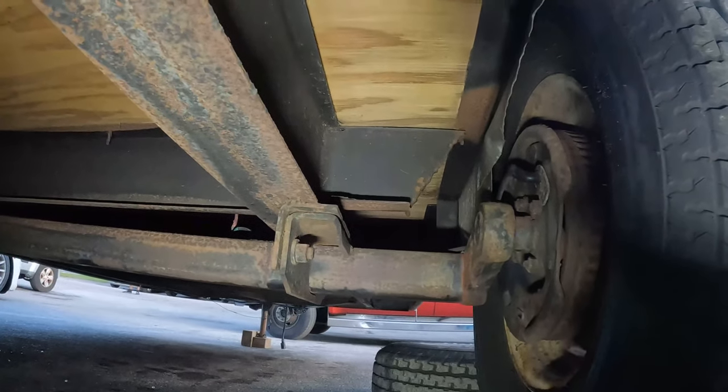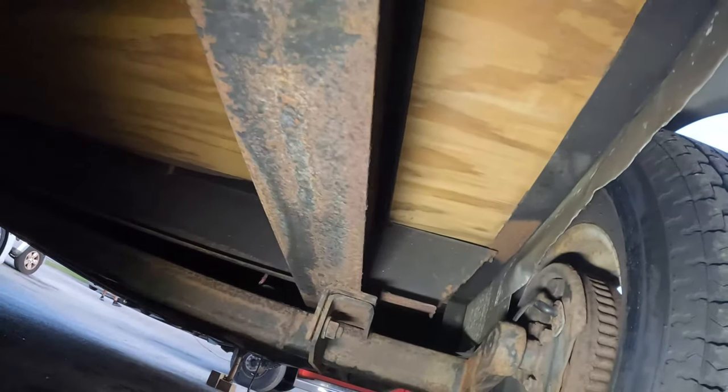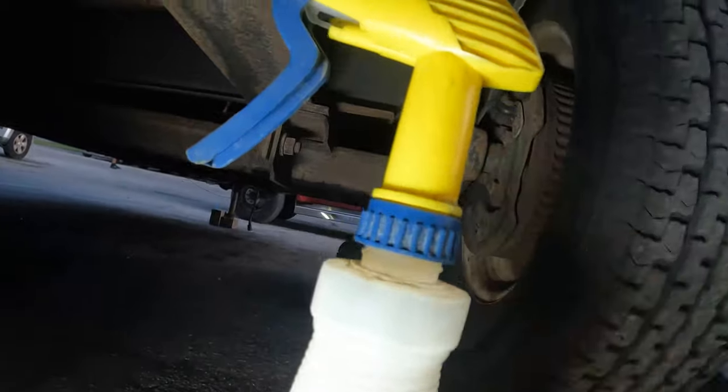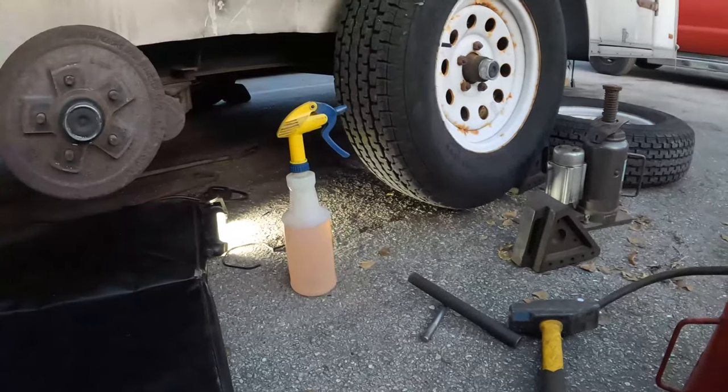I got it coming back over to its original spot - it's got a little gap in there but I'll push up on this right here and get that to close. Then I'm gonna get my 110 welder because it's got flux core wire which is way better for welding dirty rusty metal. Before I do that I'm gonna take this spritz bottle full of water and soak the wood a little bit, because the last thing I want to do is weld on this thing and have it catch on fire.